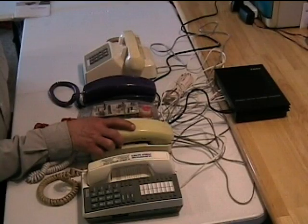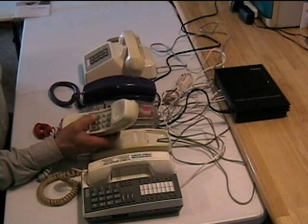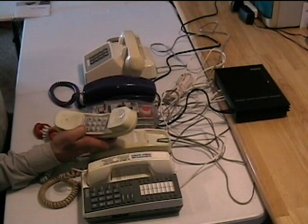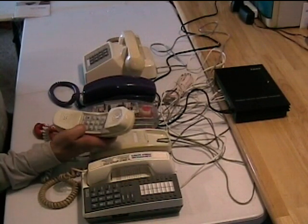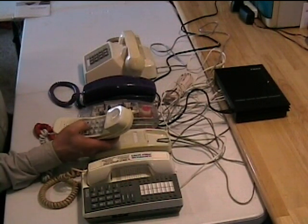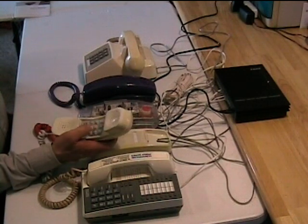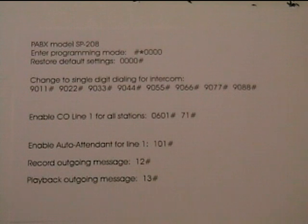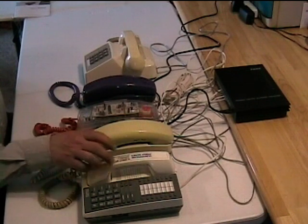I'm going to do that now so that I only have to dial one digit. I'll go into programming mode, dial pound-star-0-0-0-0, and it'll beep telling you you're in programming mode. Then: 9011 pound, 9022 pound, 9033 pound — continuing through 9077 pound and 9088 pound. That reassigns all the intercoms so now they're single digit. Then I'll enable the CO line so that's available — just line one to all the stations — by dialing 0601 pound and then 71 pound. That takes care of the necessary programming; now I can dial another station with just one digit.